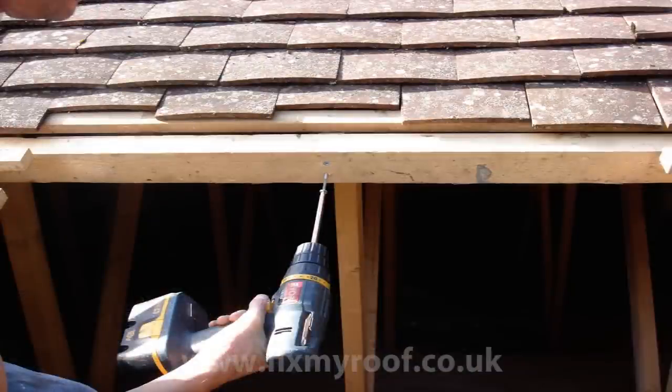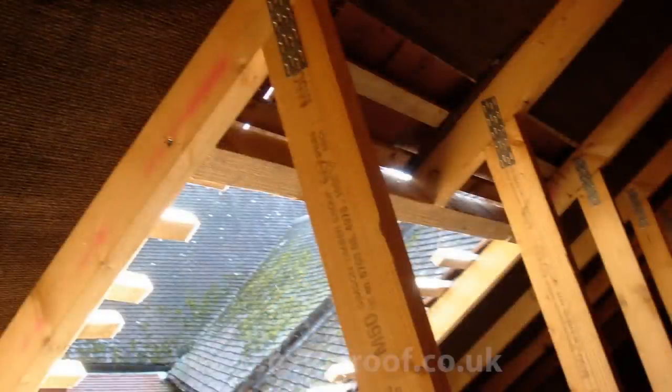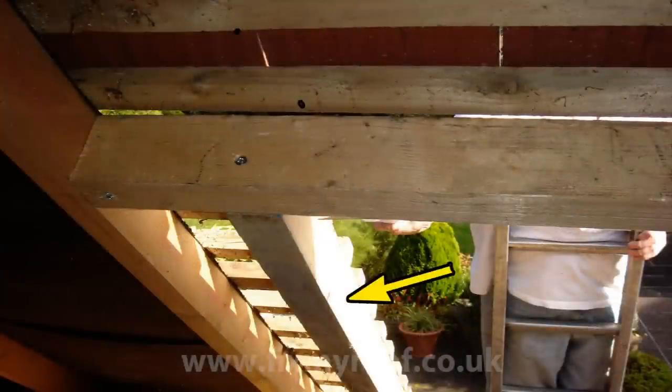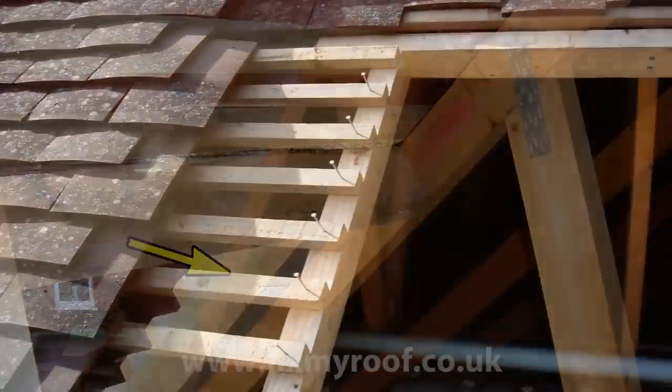Here, a section of 3x2 — or 75mm by 50mm timber — is fixed between the sides of the two trusses, and fixes into the end grain of the cut middle truss with 4 inch or 100mm screws. You can see from the inside the fixing through one of the trusses into the new section of 3x2, fixed in place. Then do the same thing with the bottom of the window and another piece of 3x2. The two side pieces can be cut and fixed into the timber pieces you have just fitted. The end of the laths should finish nicely with the edge of your new side timbers.